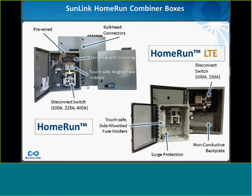So you end up pushing up to, for example, in my smallest box size in the LT line, I can fit 16. If I go to 17, I have to go to the next larger box size just to physically fit that. And so even though you might work well with a 200 amp switch to have 17, you're in a larger box size. But basically, yes, we do stock all those sizes.